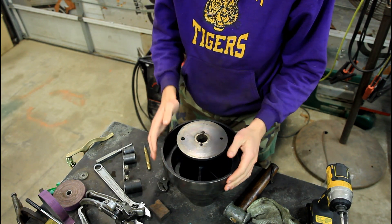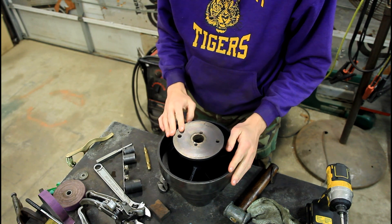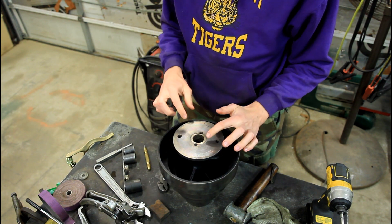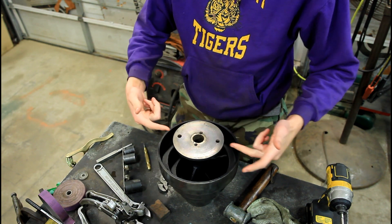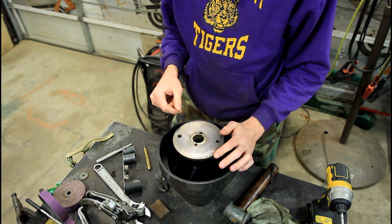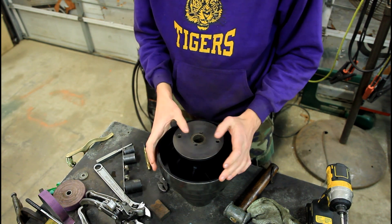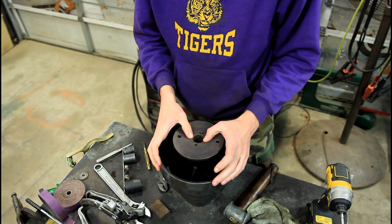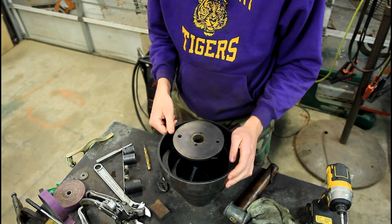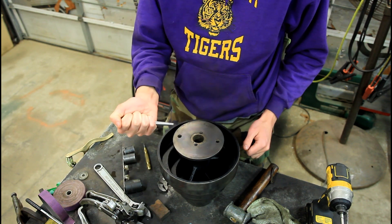I got these back on — that was a bit of a bear because both this gear and this plate are press fits. I didn't measure them but they're probably two or three thousandths press fit. For the method of locking the rotation, instead of using keys or set screws from the side, they use set screws from the end. The way these are made is after assembling, they drill and tap in place, so they're really not something that normally goes back together. I didn't want to have four sets of holes, so I really wanted to get them back on where they went. To make that happen, we heated the plate up to about 600 degrees, used a little alignment punch to get it centered, and had about three seconds before it froze up on there.